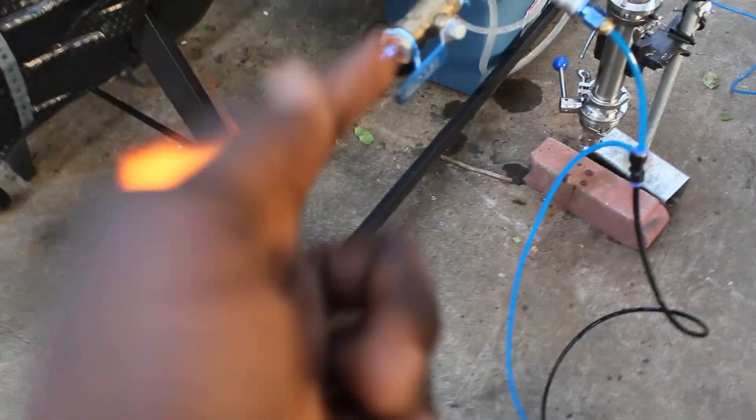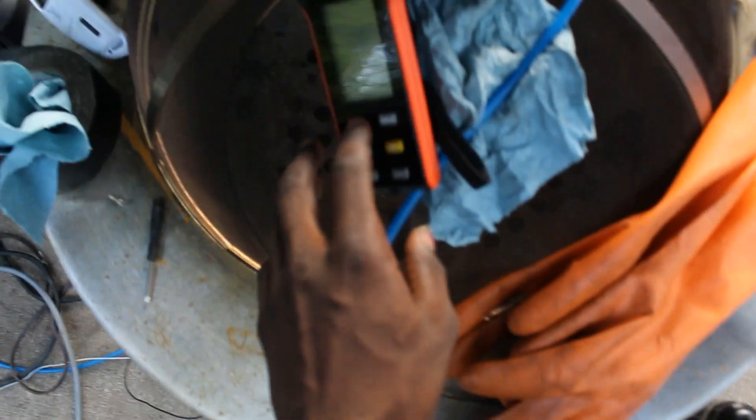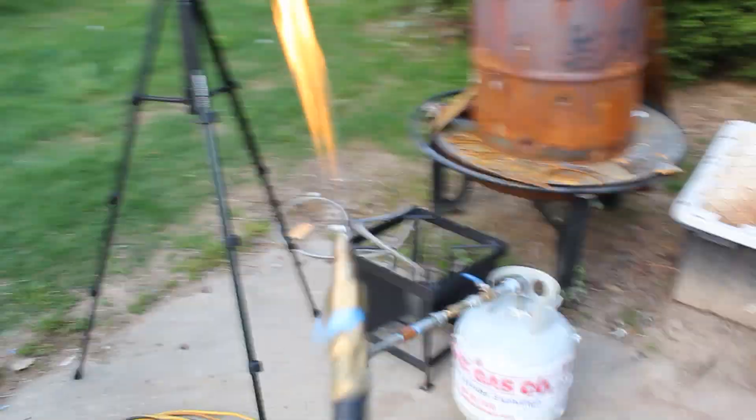So we have the yoga ball hooked up to the regular out port. We're going to turn this valve off, and then we're going to actually plumb this high pressure port out here. I have a valve on this vacuum pump and the valve is there to let us regulate how much vacuum is being pulled. I've got my manometer over here, and that's going to allow us to know how much of a vacuum is being pulled. All right, vacuum pump is on. Now let's see the natural gas coming out on this end - that's going into my rectangular bladder here. You can see there's a much more consistent pressure coming out. That's probably what you need for the generator right there.